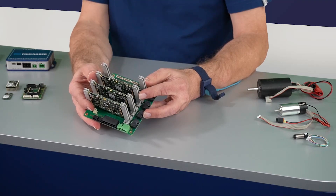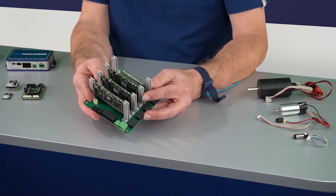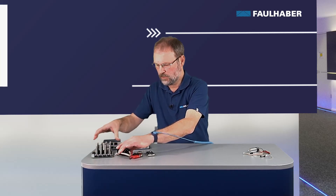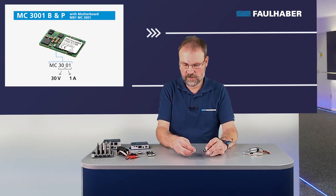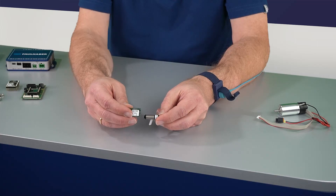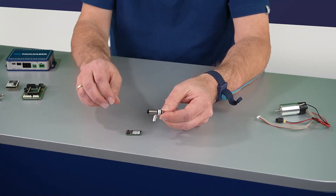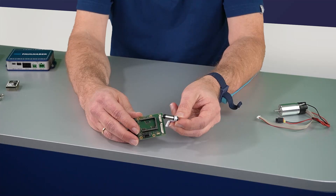The 5004 is 50 volts and up to 4 amps continuous current, which still qualifies these drivers for our medium and big motors. For the really small motors, that's no match — so our newest product for small motors is the MC 3001: 30 volts and 1 amp continuous current, meant for 12 volt or 24 volt operating systems. To connect such a motor to this driver you would use a carrier board with the connectors, or design your own carrier board.